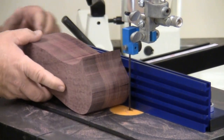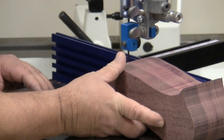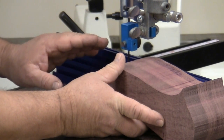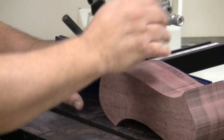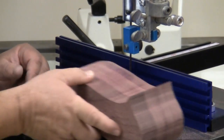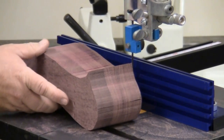Before I do this, the first thing I checked was in the back, to make sure that I had the clearance on here to cut that off. What I do is I lower this down so you got the blade guard mainly covered. My grandson was over here for a Cub Scout thing the other day, and I showed him how to use a bandsaw. The first thing I told him was, you lower this down, and then you got the guard in there so you can't get your fingers too much in the way when you're cutting. And then every time I go to cut something all day long, he reminded me, because normally I don't check it in the back like that. I just look at it and say, yeah, that's clear.